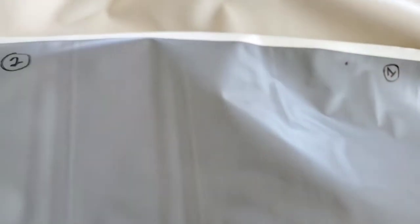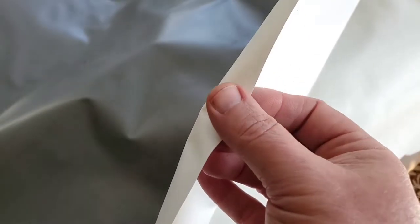One of the motorized screens that I've coated it on has a texture on the screen surface. So we're going to drill in and show you just how this really adheres to that texture. It doesn't fill it in. It isn't like it smooths it out. That's not the purpose of this. So this is going to cling to whatever texture you have. So you want to make sure that whatever surface you're painting this on has a very low texture. Okay. I would not recommend painting over screens that have been previously painted unless you thin out the texture on the surface with a primer.